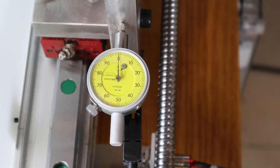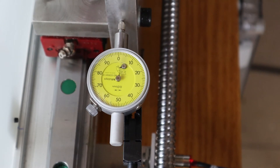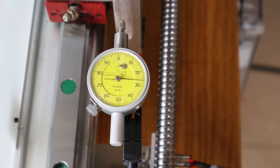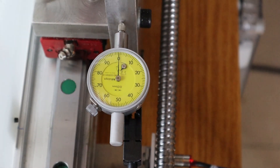Once that is done I'm going to come back and do some measurements on backlash because I'm hoping that has now improved with the new bearings. I have one other idea and that is to get inertia into the picture as well. So I'm at Y70 and I'm going to program the machine to go to Y100 millimeter, then do a G0 Y70 back to the position onto the dial indicator.